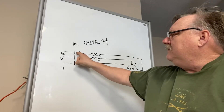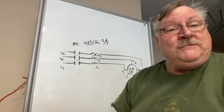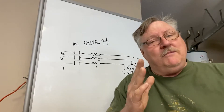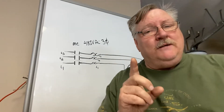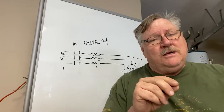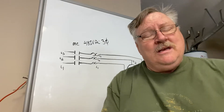You could have bad contact here — the actual contact points could be bad. You could have lost a fuse farther up in the line on that circuit, so you only have two phases that are pulling. When you check your amp meter and check on each one of these phases, those current draws should be consistent — if it's five amps, it might be 5.1, next one might be 5.2, the next one might be 4.9, but they should all be right there. There's an exception: if you have a motor with an electric brake, you're going to have two phases with higher current than the other, because that brake is operating off two phases of that three-phase motor. But that difference will be minimal — maybe an amp or an amp and a half.